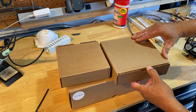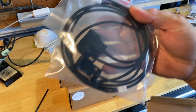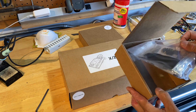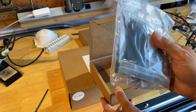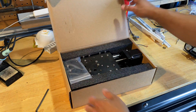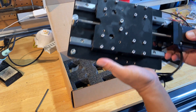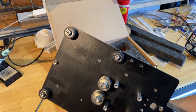The kit arrives in three small cardboard boxes. The first one has the three prox switches, which is a nice upgrade. The next box has some zip ties and a daughter board for connecting the proxes to your old Shapeoko circuit board. The third box has the actual Z axis itself and this is the mounting bracket for the spindle mount. This thing weighs probably two or three pounds — it's solid steel on the back. It also comes with the upgraded heavy-duty eccentric nuts.